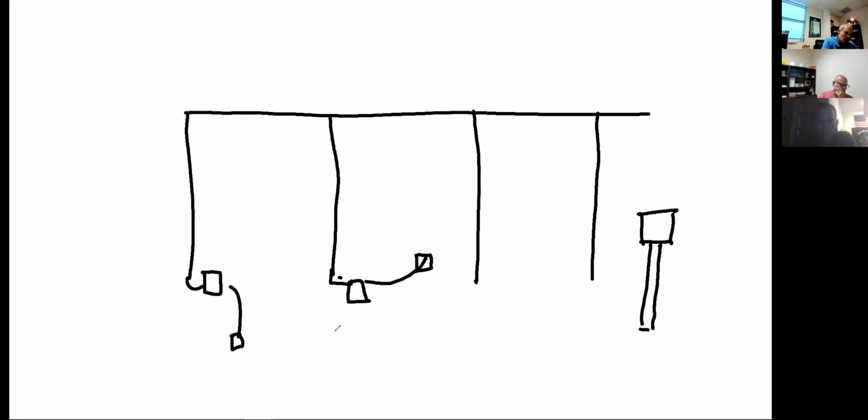So you can pick up the overhead? You got it. It will pick up overhead, primary, and secondary. So if you're walking down under a power line and you're trying to locate parallel or in line with the overhead line, you might get some false readings right there. That's in the 60 Hertz mode. It's going to be picking up the magnetic field from here, and it's going to be picking up the magnetic field from here.